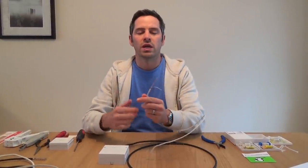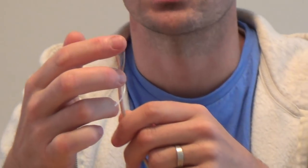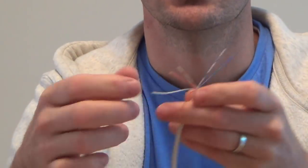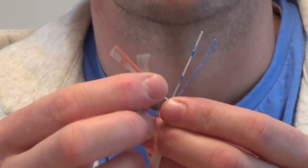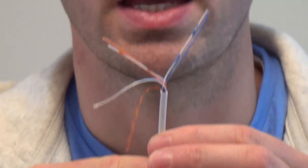I'm going to talk about the wire to begin with. A lot of people get confused about the different types of wire there are. It's always called in pairs because with telephone wire the wires are twisted. So each pair of wire are twisted around each other. So in this cable, this is a four core cable, but it has two pairs. So there's four wires in it, but there's two pairs. This is a two pair cable.